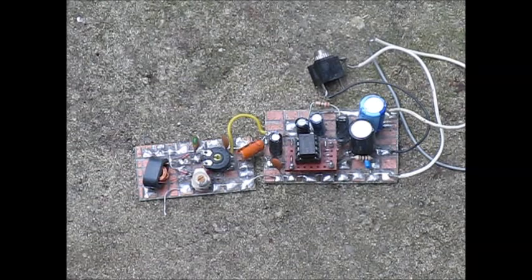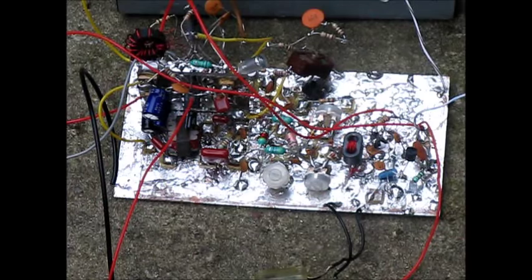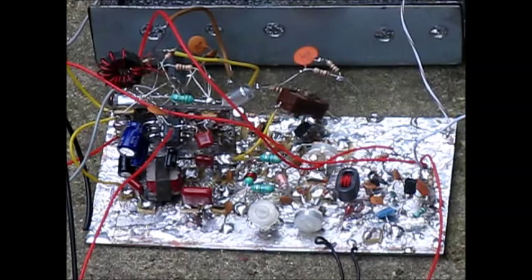There's nothing to stop you combining different construction methods in the one project. Here's a case where there's an IC on a small piece of matrix board, which is mounted on a larger bit of blank circuit board sawn into squares — in this case, a product detector and audio amplifier of a direct conversion receiver. Here's another example using small squares of circuit board material, or what's sometimes called Manhattan style. Then, when that gets a bit too hard, like when ICs are used, I regress to the so-called dead bug construction. It looks ugly, but it's quick to build and easy to fault find. The project, by the way, is a phasing-type SSB transceiver — the receiver is working to my satisfaction, but more work is needed on the transmitter.